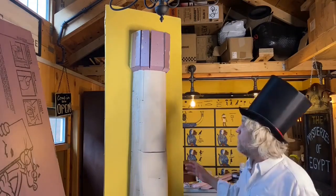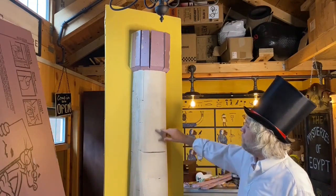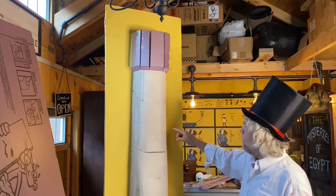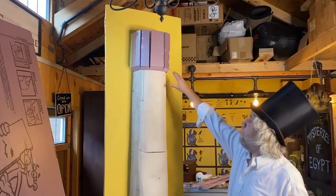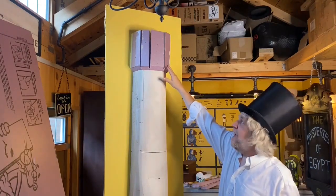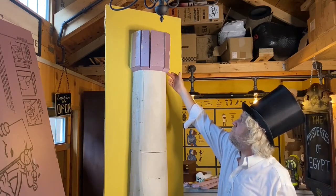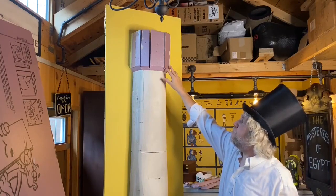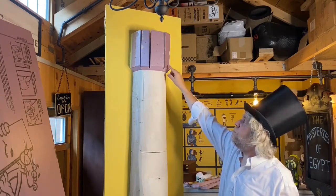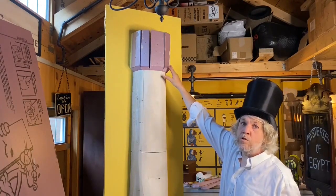I've been hard at work. This is the front of the column. I went ahead and put a second coat of paint on the column itself and fastened everything together. Up here for the capital, this is just more leftover foam that I had. All I did was put a 45-degree cut on the ends, put some glue on the back of the foam, glued it to the top, and then used my nailer and shot some nails into the foam to hold it while the glue dried.